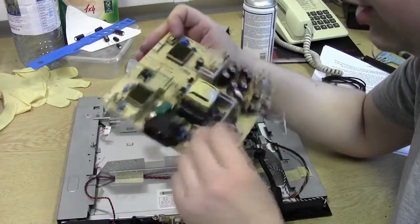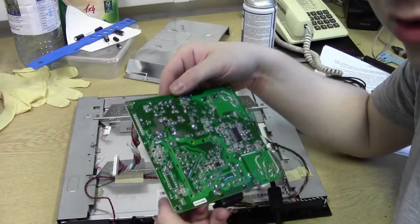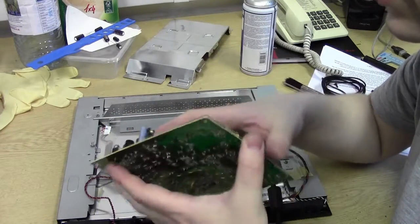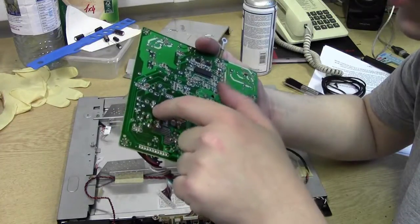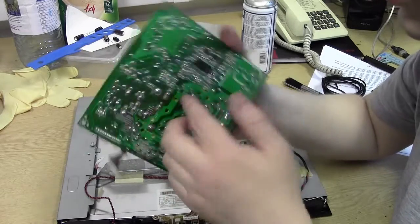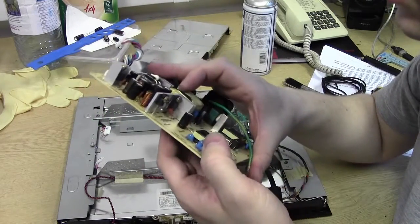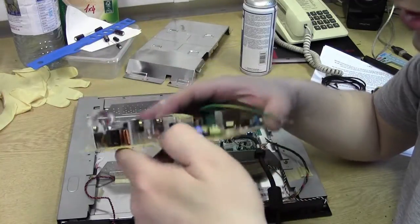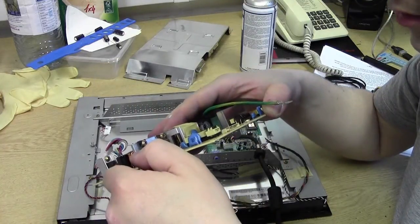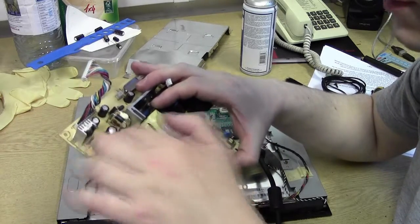And if we actually do that, this is where the trouble spot was. There's no actual thermal damage around that area. They are in actual fact decoupling caps. Okay, they go between the actual 0 volts side to positive supplies. They come in from this transformer. Yeah, actually, some across the transformer, some across these components here. Looks like it's a bridge. Yeah, so we've got a transformer going to a bridge. It's heading off to these caps here, just for suppression.